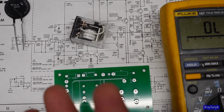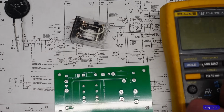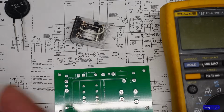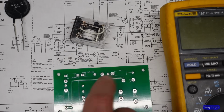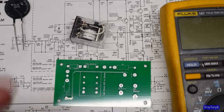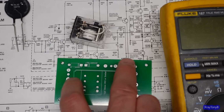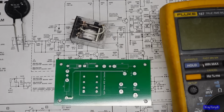So you want to have at least a 7-watt resistor in there. You want at least double the wattage that the resistor has to dissipate. And remember, if you put a 7-watt resistor in there, they're going to run pretty warm. I put an aluminum 25-watt resistor, 2K on each one, and they're not much bigger than that, and they get warm. They don't get real hot. But that's how you calculate it.